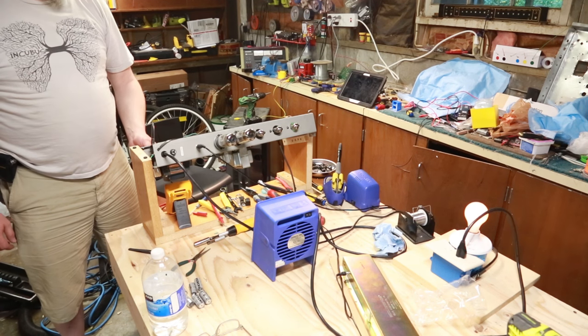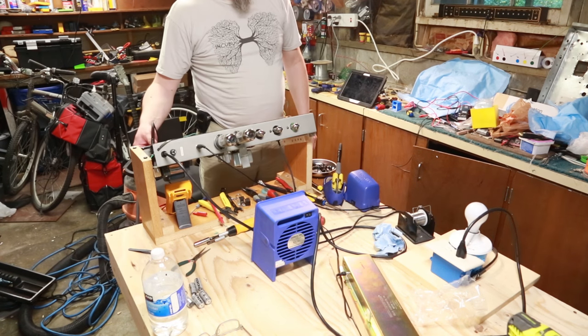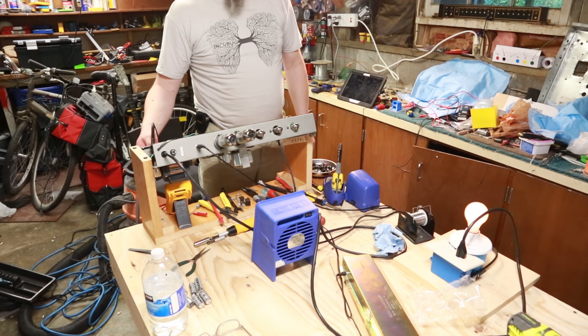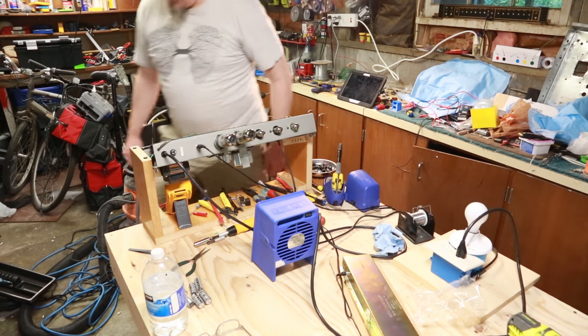We will turn her off, switch out the light bulb limiter, and try it again. Actually, I should probably do this first. And that looks okay too. Just a quick inrush. All right. Looks good.